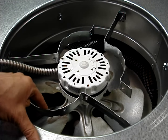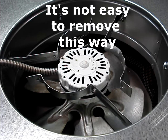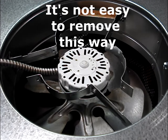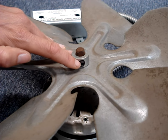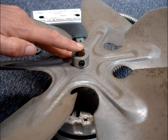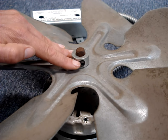There are three practical ways to get the fan blades past the brackets. You can bend the brackets back and wiggle the fan blade past them. If you don't have a helper to hold the brackets back, you can cut a piece of wood around four and a half inches, wedge one of the brackets back, then wiggle the fan through while holding the other two brackets back. You may also be able to get the 5/32nd set screw loosened and remove the fan blade — this one is quite rusted, so spray a little penetrating oil on it, wait, then try to loosen it.